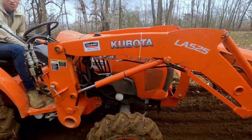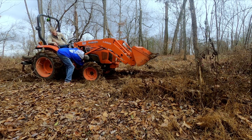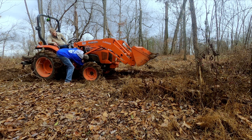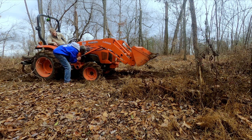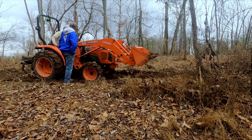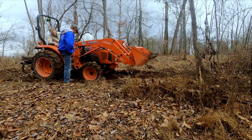Originally it just died and we didn't know this, and it wouldn't restart. We looked at our water separator and it had quite a bit of water, so we cleaned that out and tried using it again, but it had the same issues. If you turn the key and all you hear is a click, fuel supply is not your issue — it is likely a safety switch.